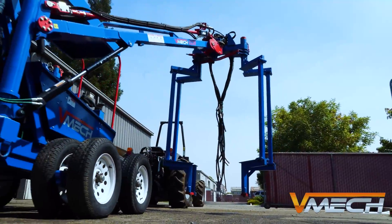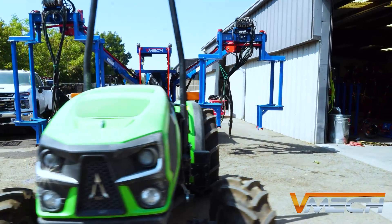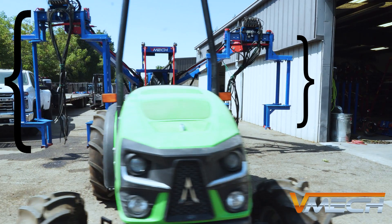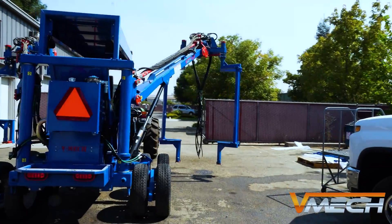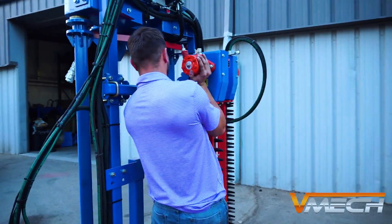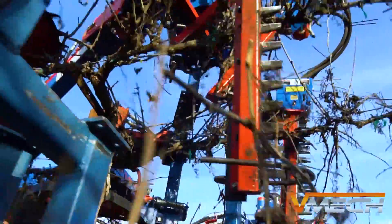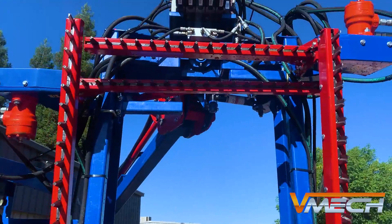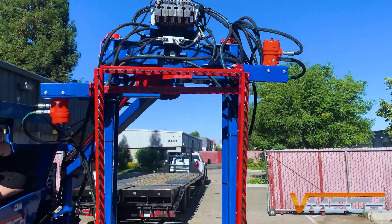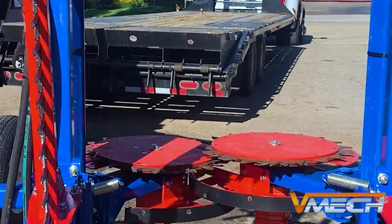This head here is something we came up with this year as well. It's essentially the quad head exploded to hedge a variety of crops — for example, the high density of olive or almond trees. With this setup, we hang 60 inch sickle bars vertically to hedge the sides and sickle bars on top horizontally to top the crop. Then we hang our sprawl cutters underneath to cut the skirt.